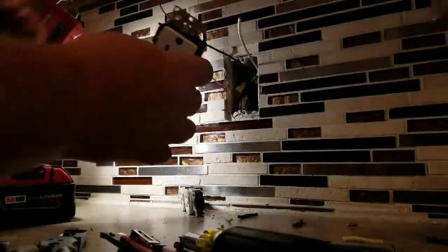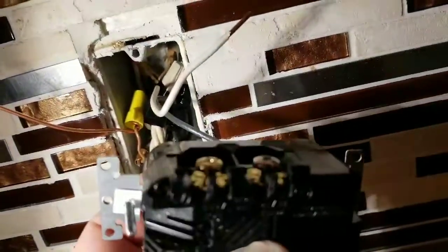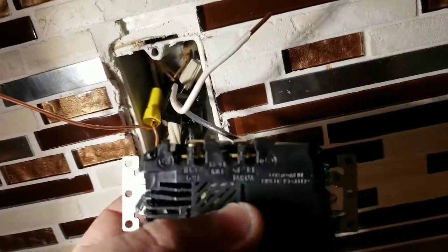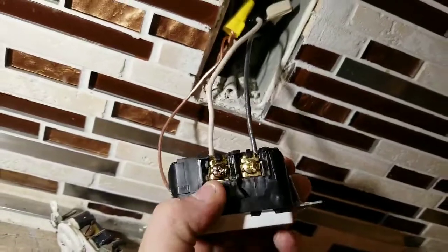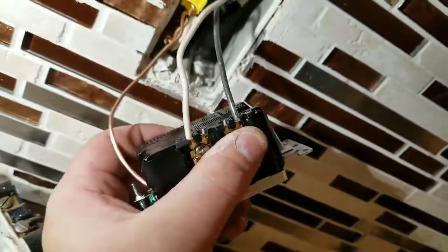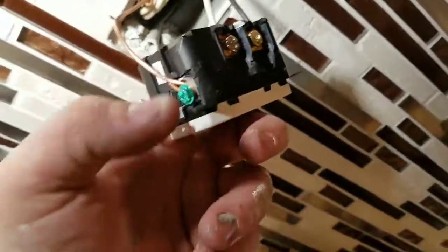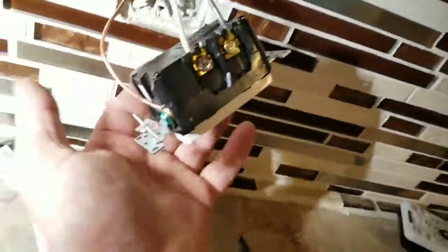Everything's pushed back, and I'm going to cut these just so I have enough slack to bring it out and unscrew it if I need to. Cut off about a half inch, maybe a little less, just to fit inside right there. These are actually labeled in the back — white and black — but you can always tell: the copper is going to be your hot, and then the silver or chrome is going to be your neutral, and green's always ground. This also says it on the back — you can see 'hot' and 'white.' I keep these as far away from each other as possible. Then obviously for the ground, when you're going around a screw, you go clockwise as you're screwing it in, so you're tightening it and it's pulling it in at the same time. It's just another safety precaution.